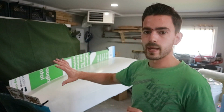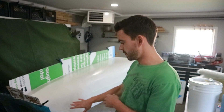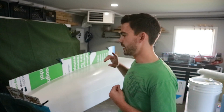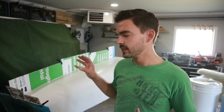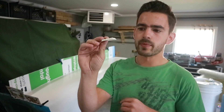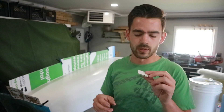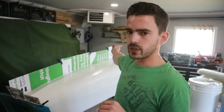There's our flange done. We got the whole flange along the middle and we also put that little one on the bottom there so we don't cast the underside. Next step is going to be registration dots. The plasticine worked but it was kind of tough to remove from the mold once we pulled the flange off. So for this one we're going to use these little rubber door stoppers — got these from the dollar store for next to nothing. We'll stick a couple of those on the flange and hopefully they'll make nice registration dots that we can just pop out really easily.